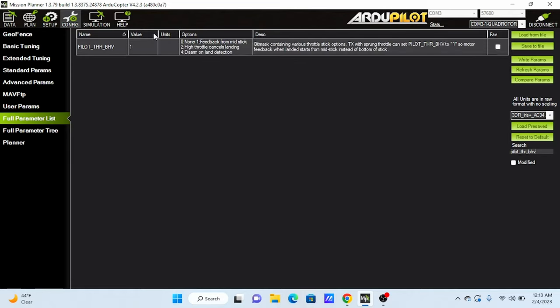So yes, we can control a drone with a telemetry radio once it has been configured with an RC radio. Telemetry radio has an advantage for flying the drone since it can gather all that information from the drone and stream it to your laptop. The disadvantage is the latency or the slow response since all that information being gathered is being streamed serially.